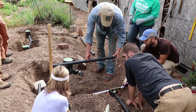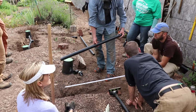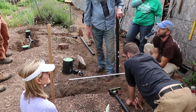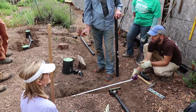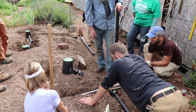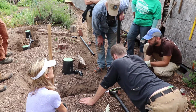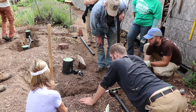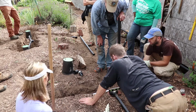38. And then what's 3/4? Anywhere between 37 and 3/4 and 38 and an eighth. It's from face to face. Yeah, but it doesn't have to be exact because look how much play we have down there. It can be longer. But I'm just saying to learn how to measure it, we're adding 3/4 on each end. Right, because you need to account for the hub. Can we not just measure from inside, right here? I mean, you can. So you add an inch.